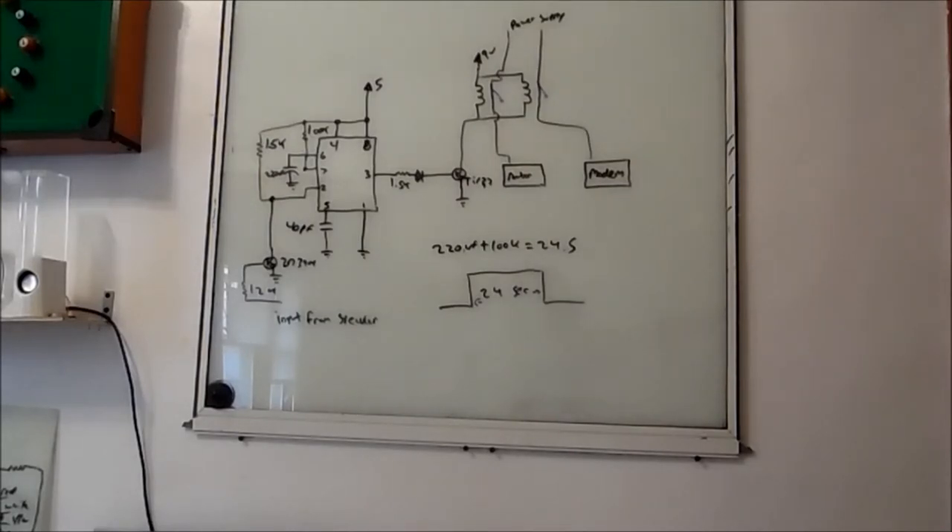I was left looking for another alternative and came up with this: a 555 timer in monostable mode that outputs a pulse of roughly 24 seconds. The timing components are a 220 microfarad electrolytic capacitor and a 100k resistor, which gives roughly 24 seconds. Standard reset time for most routers and modems is a recommended 30 seconds, and I'm hoping to achieve a few more seconds from the wireless transmission part. The circuit will work if you just push a button to reset without actually unplugging, but I wanted to make it wireless.